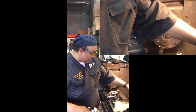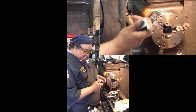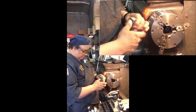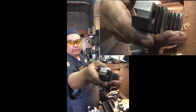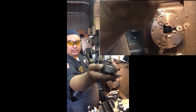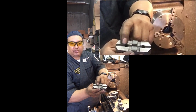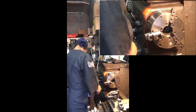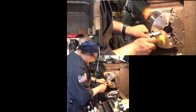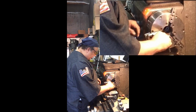And just like we took them off when we put the soft jaws, they're all numbered. This one is number 2 right here. This one's number 3. This one's number 2. You just see it right there. Right upside down. But get the point? So again, they have the channel in there and the pillow blocks. So we just line them up. Just tap it in. Put the shoulder bolts.